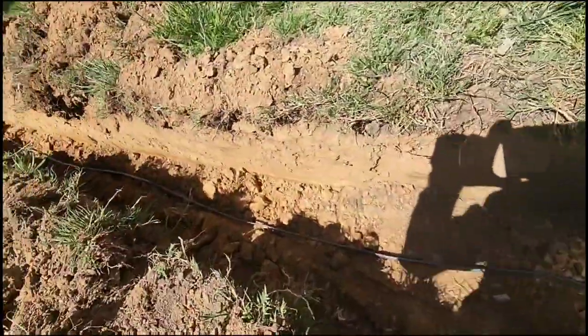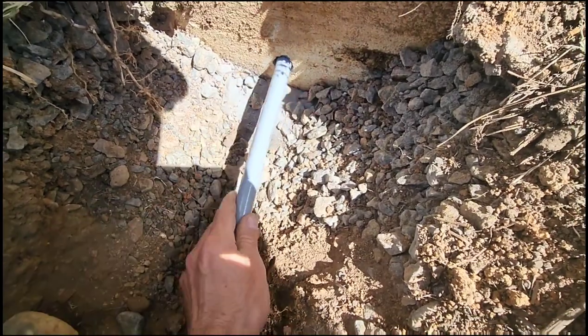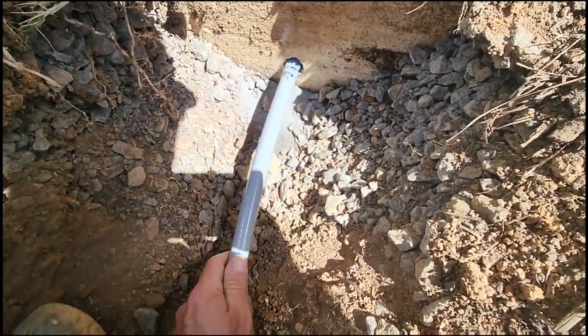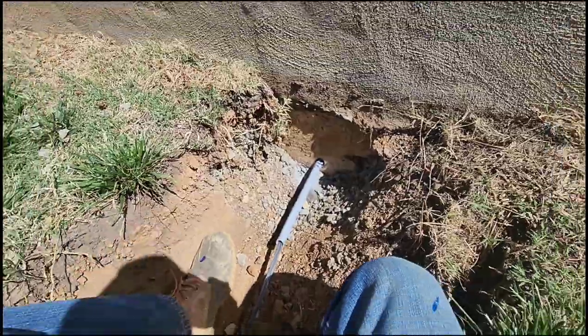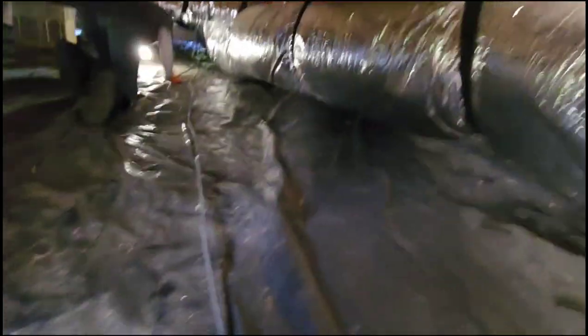All right, got the wire all nice and tight. We're gonna take this conduit and we're gonna feed it through both blocks. And then now it's protected on both sides from this gravel, as per the inspector. Okie dokie. Oh, take that bend out of it.